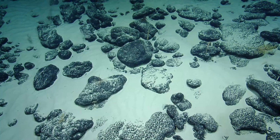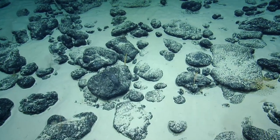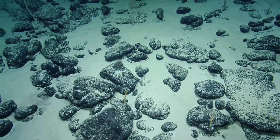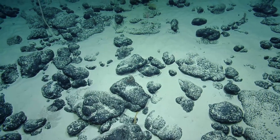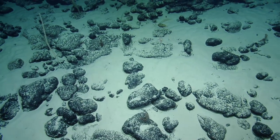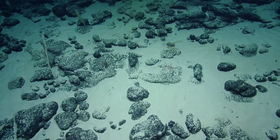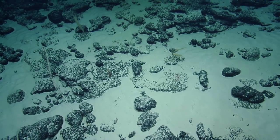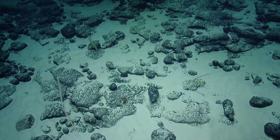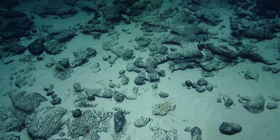I just know that someone on another watch, who spent many years on this ship, plugged the printer into the wrong voltage. So it's a mix of 110 volt, 60 hertz for all our U.S. stuff, and then the ship is European, so it has 220, 50 hertz native power. And a lot of things run on 480 volt three-phase power, a lot of the high-power stuff.